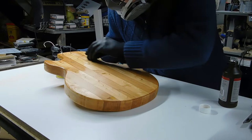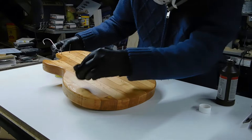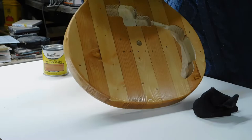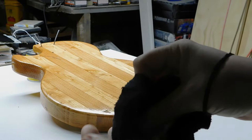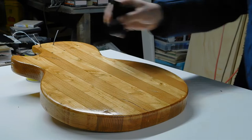The bottle and many tutorials say three to five layers is enough, but to build up a really high gloss finish you'll need more. I ended up applying nine coats before finish sanding and three more at the end. On coat three I started using duct tape to remove lint from the cotton cloth to avoid transferring it into the finish. On coat four the finish hadn't dried as thoroughly, which is when I started extending drying times. On coat seven I used a hair tie to hold the applicator bundle together for better comfort.